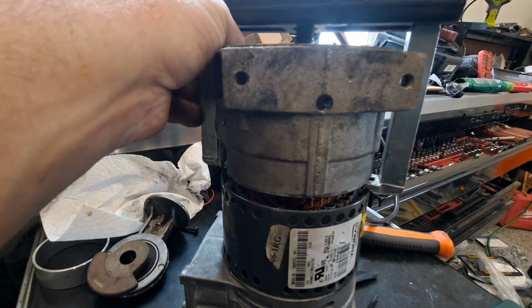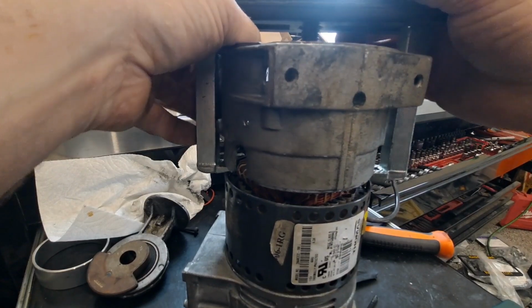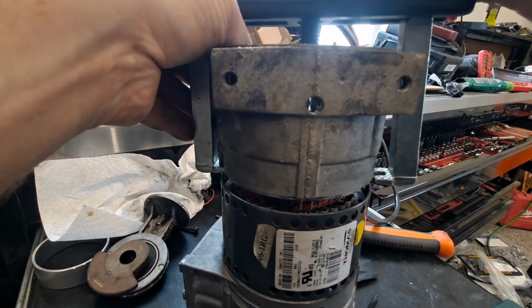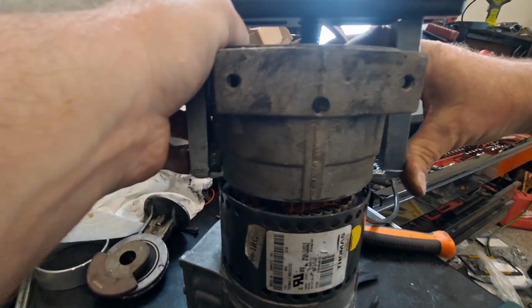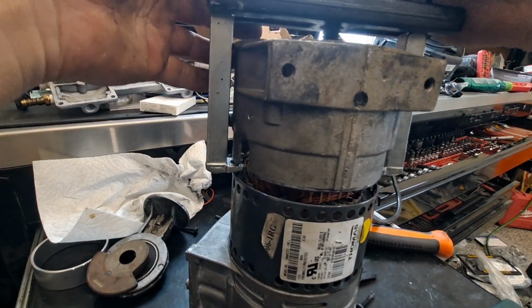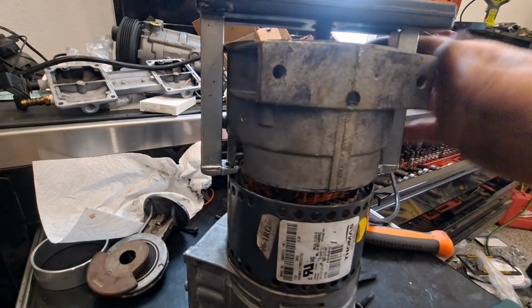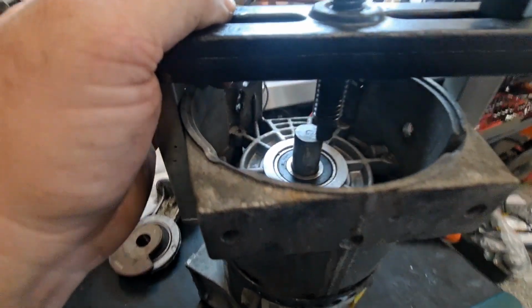So the whole jam after that is getting the puller arms under the lip, and then I'm going to start to spin that center, what they would call the arbor of the puller. So the threaded rod right now I'm threading. I'm trying to get it tightened up and have everything sit just right. So that one's just barely grabbing. The problem is if I look at my shaft in there, I'm just barely catching.